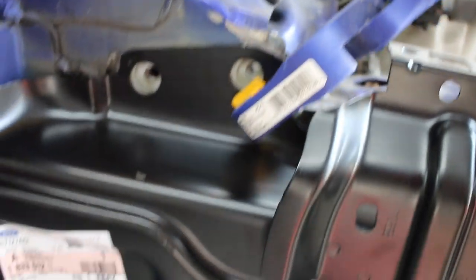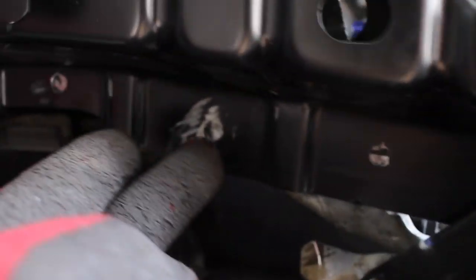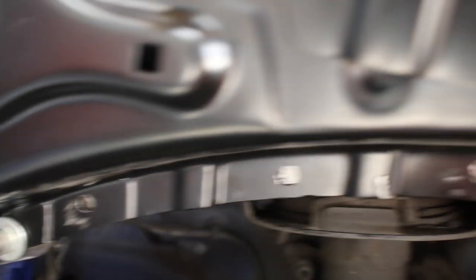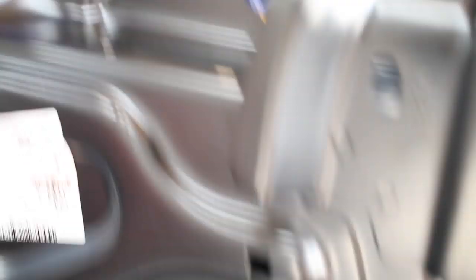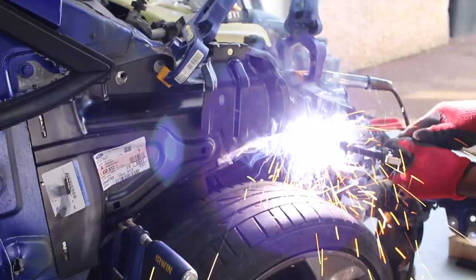The outer piece is now put in place and lined up perfectly — down the bottom as well as at the top. We've drilled some holes here, essentially mimicking the original spot holes. What we'll do now is weld those holes up and that should put them in place. Of course we've also got three big welds down there to do as well. Let's get on and do that and then that should complete this piece.